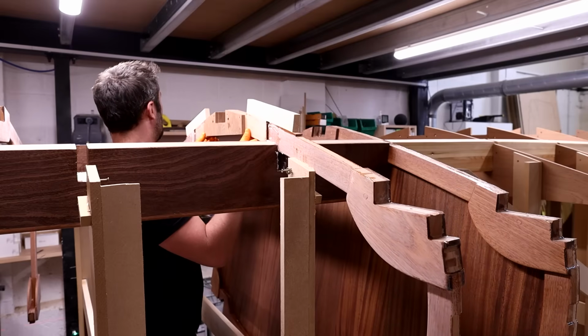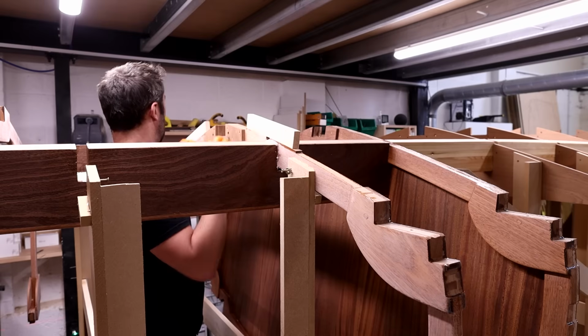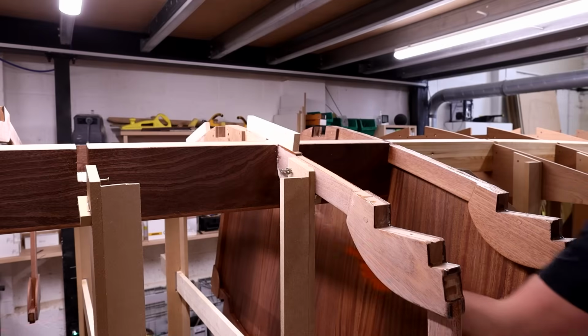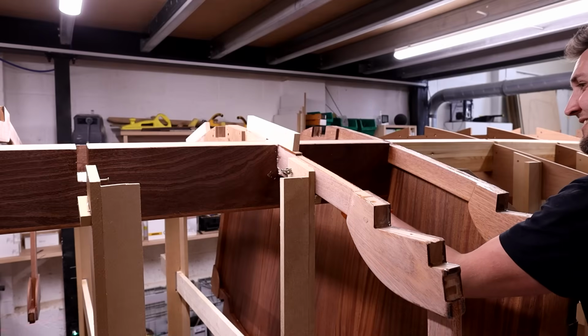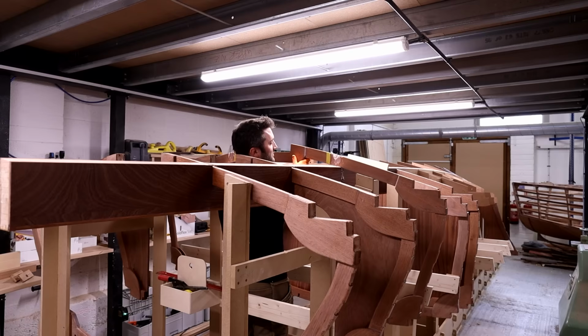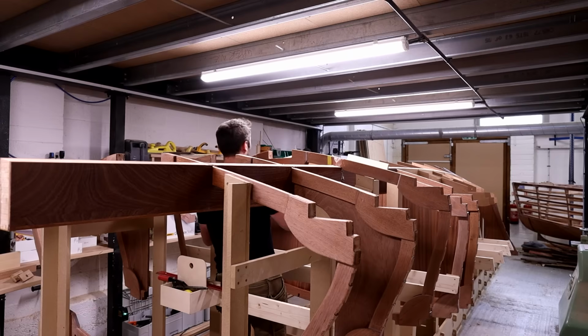So by applying that to the side of the frame as well as within the notch, it means that as that frame lowers down into the notch, it's taking epoxy down in with it as well. So we prevent that effect from happening. It's very important in a circumstance like this where you've got a notch which has potential to kind of slide all the glue off the joint.